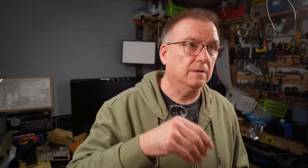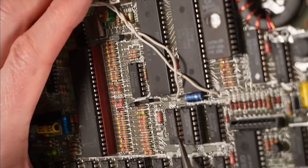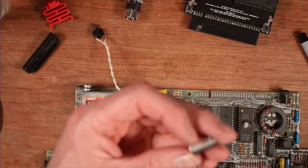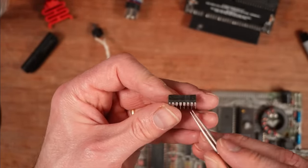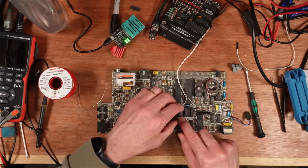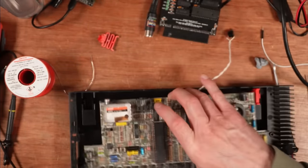I was just about to start taking this chip out without recording it — there are only so many of these things you can stand. But I noticed corroded legs on IC15. I wonder if there are any on the other chips — there's a little bit of corrosion on the adjacent one too; it looks like something was spilt on top of them. Chip is out — another dead one. That's that chip change — let's see if it wants to work now.